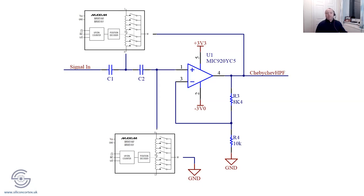Because if you want digital filtering, apart from doing averaging, if you want something slightly more sophisticated, the maths can get quite heavy, and I'm really not sure an M0+ could do fast Fourier transforms. I don't know if anyone's tried. I guess that's a no. I do know that it has been achieved for a moderate-sized FFT, like 500 to 1,000 points, using integer math rather than floating point math. If you did 1,000 points, that's about 500 hertz, but it depends on your frequency bandwidth. So if you're doing audio, you might have a problem.